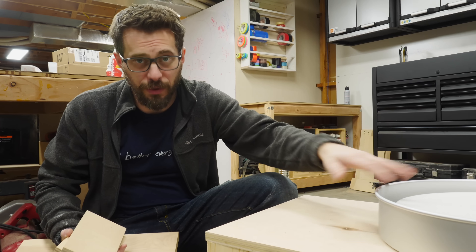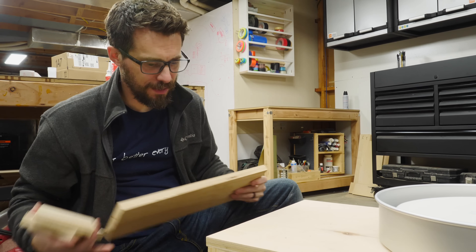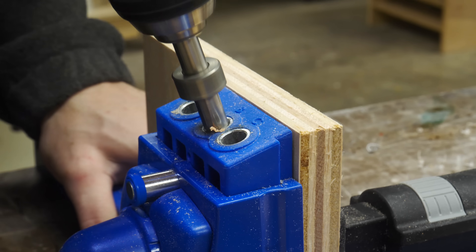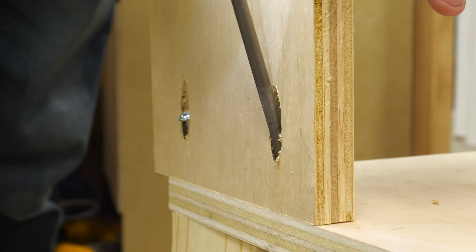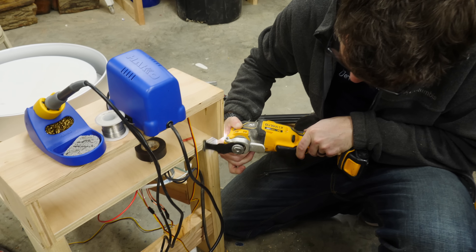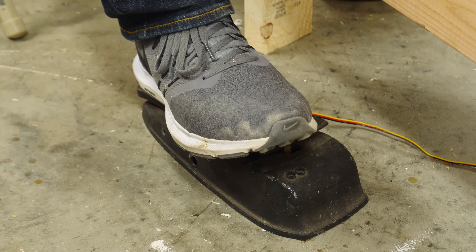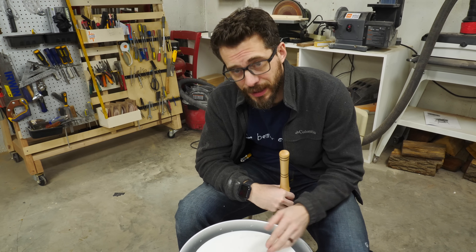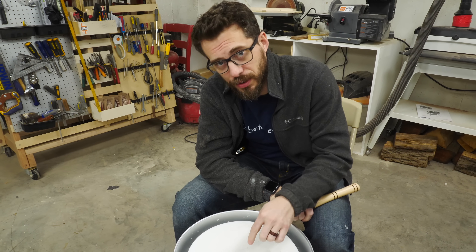I think we're pretty good. It seems to be running true, it's held in place, and it's quiet. So last couple things: we're going to put a little shelf here just with some pocket holes and plywood, add some more pieces to cover up all the electronics and keep them safe, and then extend the switch around to a place where we can easily get to it. We're also going to add some circles — all the different pottery wheels I've seen have different concentric circles on the bat so you can find the center easily to put down the clay. I'm going to use one of my turning tools to add some circles all based around the center point.